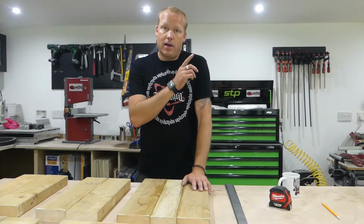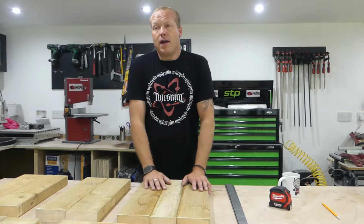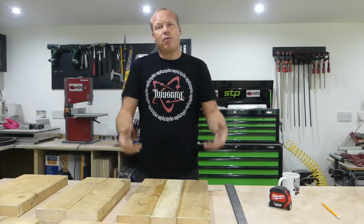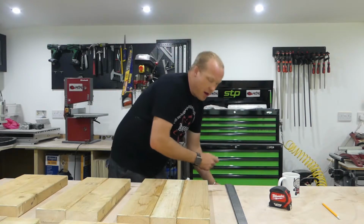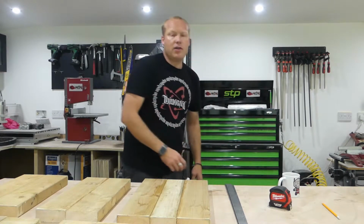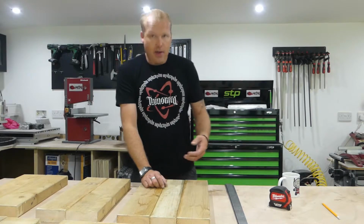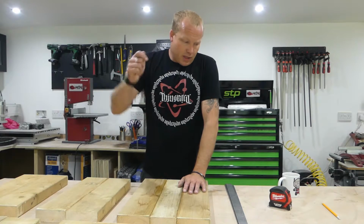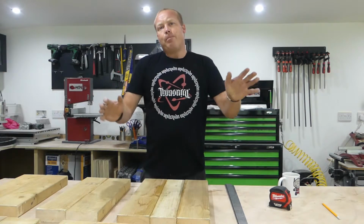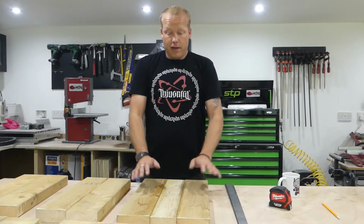I've got my anvil on a cast iron one that was made with it. It's a Brooks anvil. It comes with a cast iron stand, but the problem with that is the working height means I'm very bent over while I'm working, and it's not very good. I can't hold work between my legs to connect things together, hold things while I'm chiseling it or whatever.